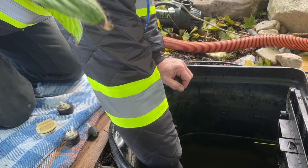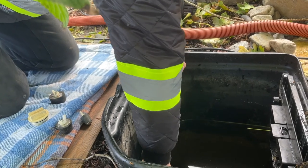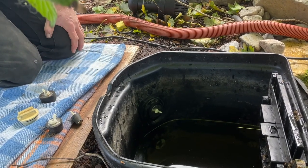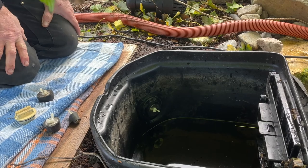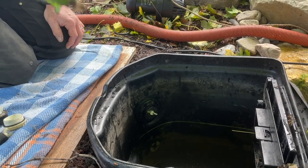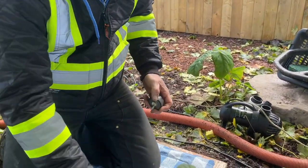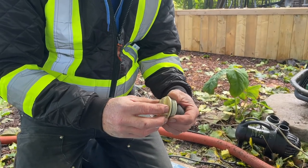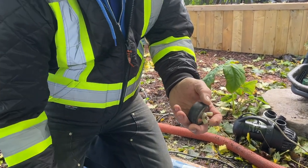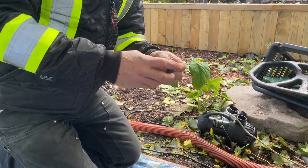For argument's sake, I'll use this one on the other side — so no water could get in the overflow. Now I know when I put the pipe in for mine, it runs downhill all the way — I made sure when I put it in that I didn't need to vacuum it out. Now correspondingly, I'll go up to the top. I prefer the rubber stoppers over the threaded fittings — these I find get brittle over time and sometimes break. The rubber stoppers I find do a little better. You can also get these often at a pool supplier. The challenge this year will be if they only have enough for winterizing their own pools.